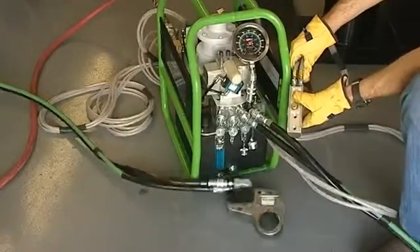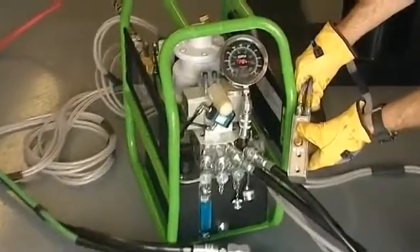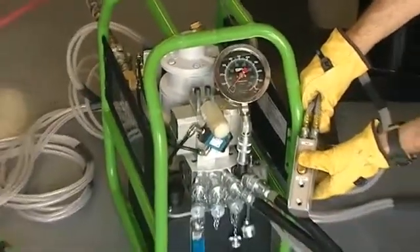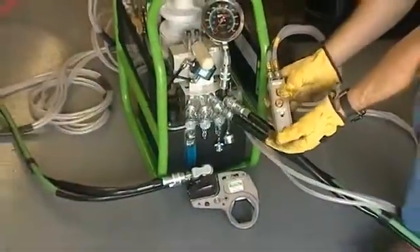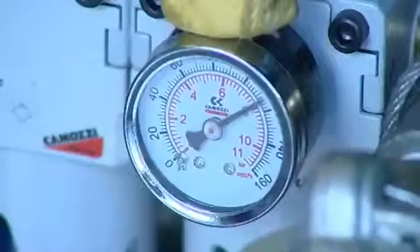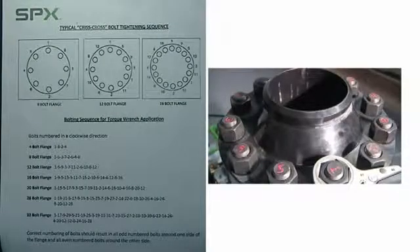With the tool on the floor, stand back and operate the wrench to 10,000 PSI. Cycle the wrench five times. Turn on the pump by pressing and releasing the advance button once, then hold the advance button down — the tool will advance, stroke out, and the pump will build pressure. Inspect the entire system for leaks. If a leak is discovered, never touch it with your hands as this could cause serious injury by hydraulic injection. Shut down the entire system and retighten fittings if necessary, or refer to the troubleshooting guide. Remember to look for leaks with your eyes, not your hands.